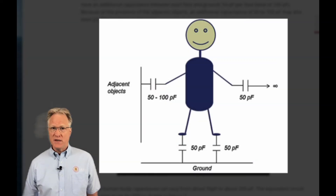The human is capacitively grounded, which means you charge up as you move around. Your shoes shuffling along the carpet or your clothes brushing against your skin can create an electrostatic charge. It's very easy to end up with 20 to 25,000 volts of charge.